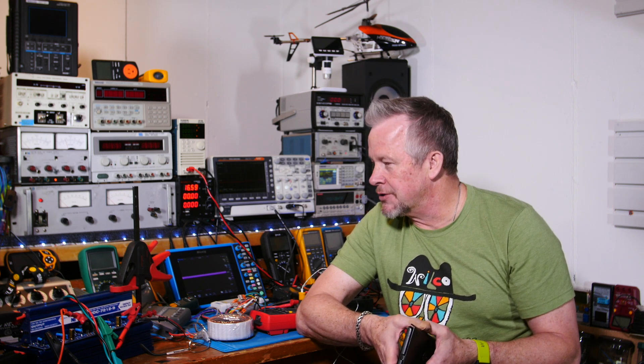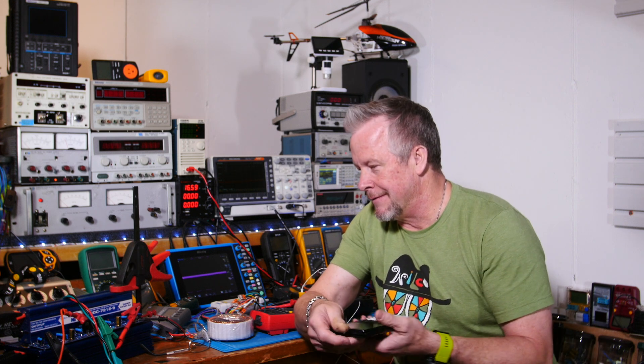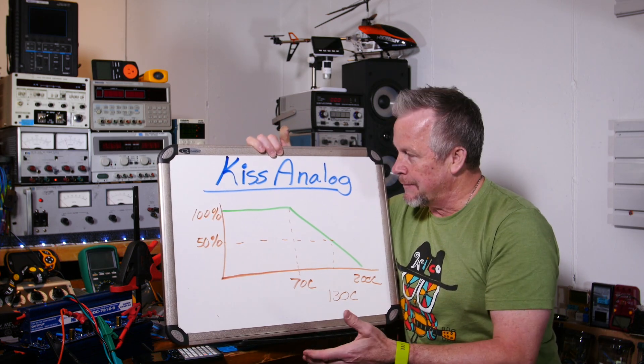That is not the right way to go, in my humble opinion. That resistor is going to run so hot that probably two years into the field it's going to burn up. Your nice circuit — where you spent all your time picking out the right capacitors, the right transistors, maybe GaN FETs — and then something starts to smell one day. That resistor is probably going to fail and burn your PCB.